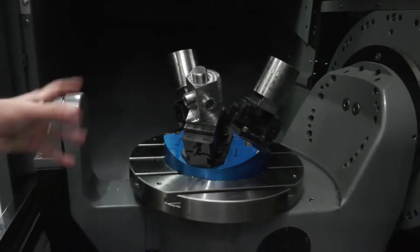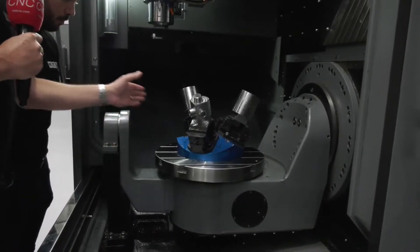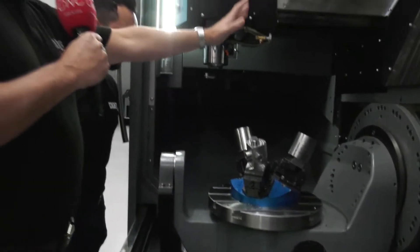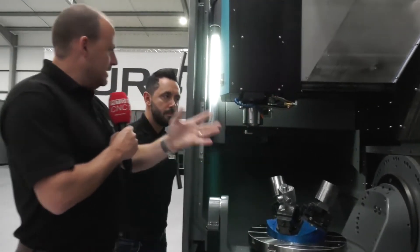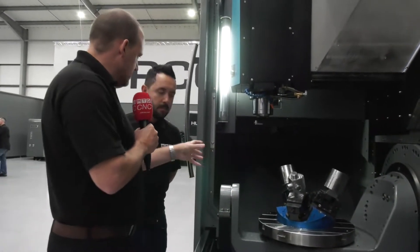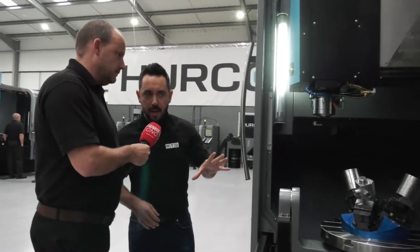This gives you that versatility. You've got the table here as well — sometimes you'll see knuckle-style tables that won't have this support here, meaning you don't have support from both sides, which obviously gives you more stability. Also with the X-axis, you're moving on the column, which is slightly different to the previous configuration where the table is moving. Your machining area is almost like a fixed point, so more weight can be put onto this table, and the inertia of moving on an X-axis is more than if you just had a fixed part. You can also have three different components on here for loading.